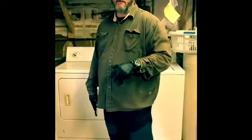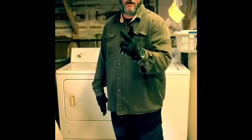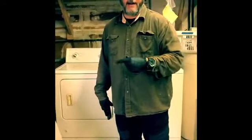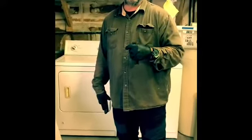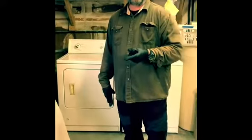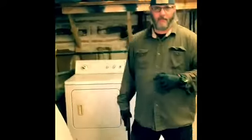Right, exactly. And then things such as in the property for safety concerns, we like to make sure that the railing doesn't have more than a 4-inch gap in it so a small child can't stick their head through it. We want to make sure that all the receptacles have plates. There's no exposed electrical anywhere where somebody can stick their finger in and get hurt. Main components of the property would always deal with safety first. Health and safety concerns for the clients is the most important thing we look for. Things such as smoke detectors. Want to make sure the property has a smoke detector and carbon monoxide. Those are some more things to look out for. So let's take a look in the property if you don't mind. Yep. Let's take a look through the property, and then some of those items that he is discussing, I'd like to be able to point out in this property.